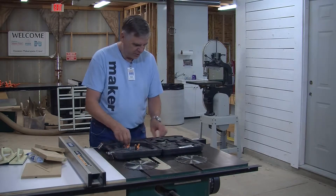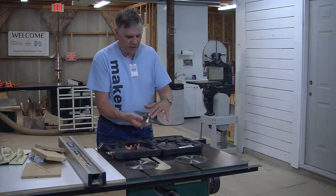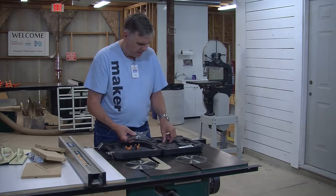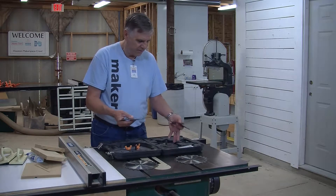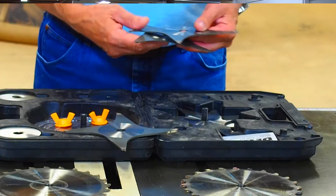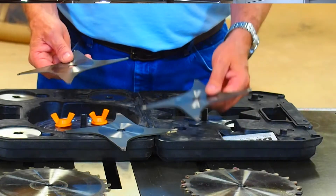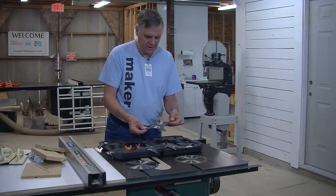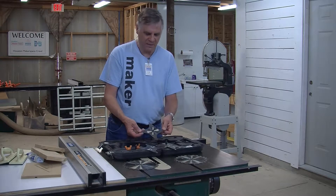The chippers are interesting — they just have four wings on them. There's an eighth-inch size; there are four eighth-inch plates. There's a 1/16th-inch plate and a 3/32nds-inch plate. So we've got four eighth-inch ones which stack up to a half inch, plus the 3/32nds and a 16th. All together you can make a stack that's almost any width you want, and with the shims you can get right where you need to be.